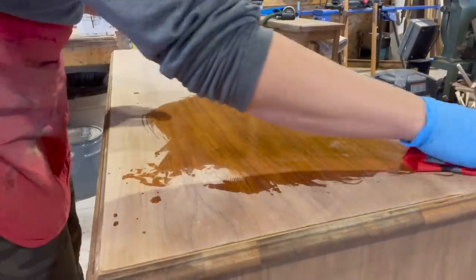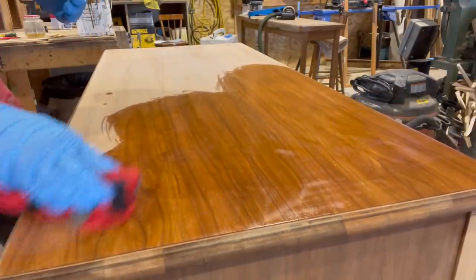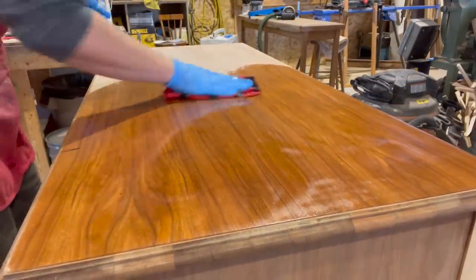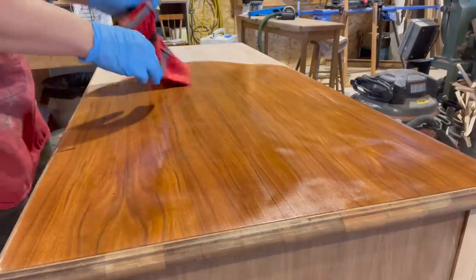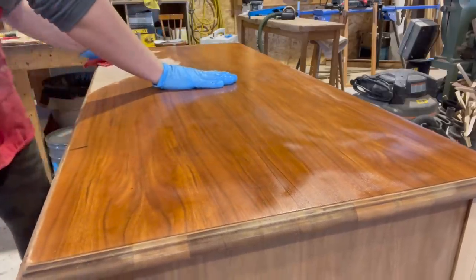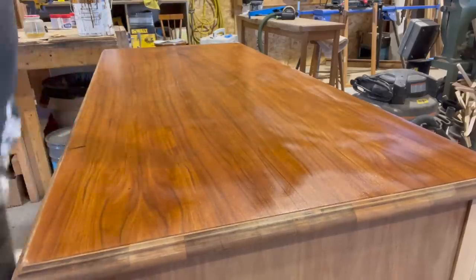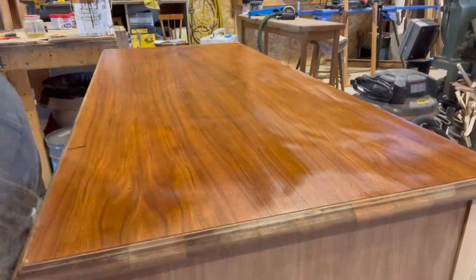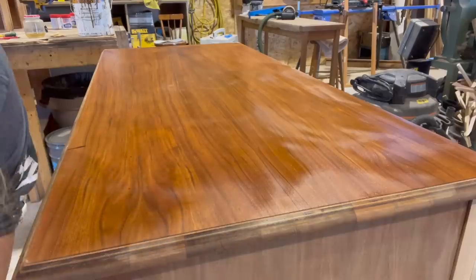and rinsing my rag. You do not want to breathe these acid crystals. You'll know right when you start sanding that you didn't get it off. And it is helpful to have the Festool because it sucks up most of what comes off of the pieces, but still, this is a necessary step.